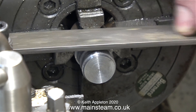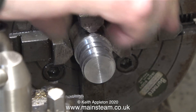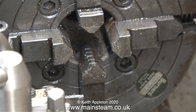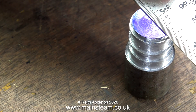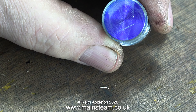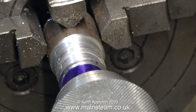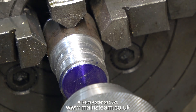In this clip I'm using a file and filing a mark on the original steel. I'm making this mark so I can refit the part in the chuck with the mark against the original jaw. Onto the bench now with the eccentric sheave blank, and I'm marking the position to drill the hole for the crankshaft. This hole will be 5/16ths of an inch in diameter and 9/64ths of an inch from the centre — this will give the correct throw to operate the valve. The part is back in the chuck in the same position it was originally, and I'm adjusting the position of two of the jaws until the centre drill makes a mark on the line in exactly the right place.